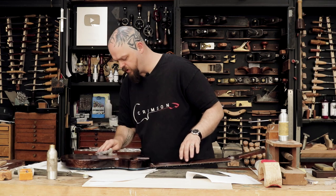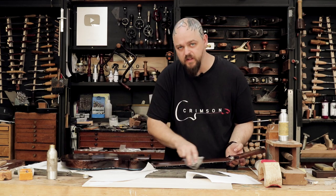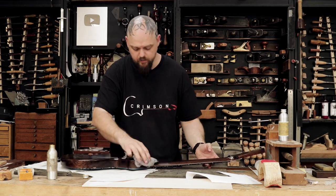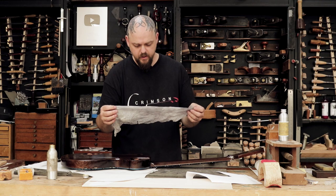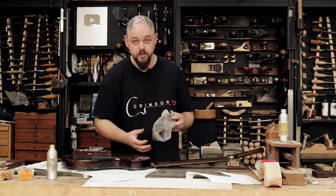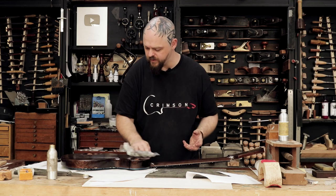I'm going to hang this guitar up for a bit. It's very hot today, so roughly 8 or 10 minutes. And then I'm going to rub off all of the excess oil and then leave it to cure while I make some back plates. Dispose of your rags carefully — this is flammable and might catch fire if you wad it up and put it in the bin. As it dries it creates an exothermic reaction and this is dangerous. I also should have worn gloves. I always forget to wear gloves.